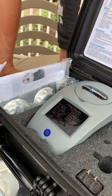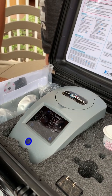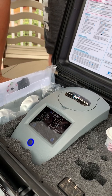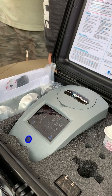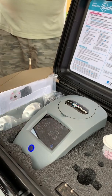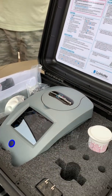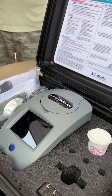How are our numbers? We said 1.5 on free chlorine, and this says 1.91. Hardness is a little low. pH 7.8, which some of you said. Alkalinity 111, which I got about 100. Hardness 189 — I got about 200 on my test. Salt — I always find about 500 off. Salt level is 3,394, so about 3,200 on average. Cyanuric acid: 5.